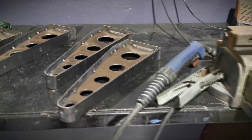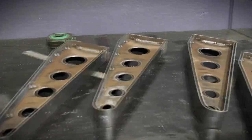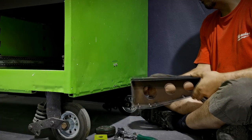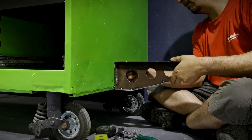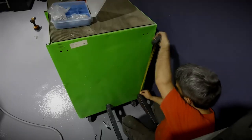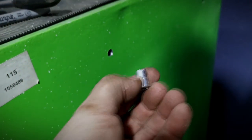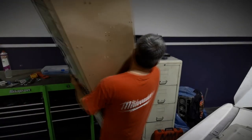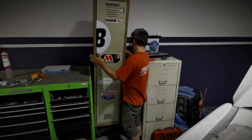Now it's time for a cup of tea, break out the rich tea biscuits, and then have a sit down and fit them all to the toolbox. We used riv-nuts for the bottom mountings. The toolbox is a bit funky — it's had some additions welded to the bottom over the years and I think something rather heavy was dropped on it at some point. I wanted to incorporate one of the existing threaded holes for the mounts but also needed to create another hole and use riv-nuts to mount those lockers on.